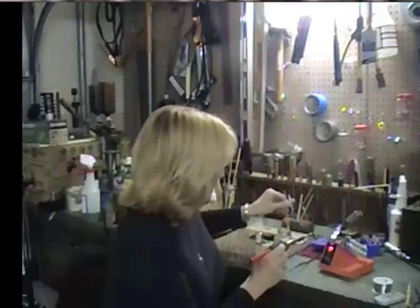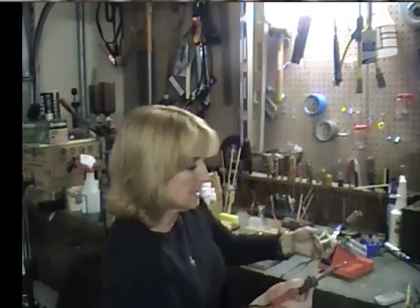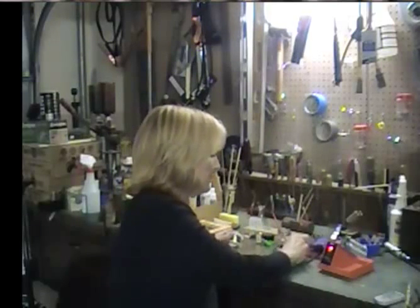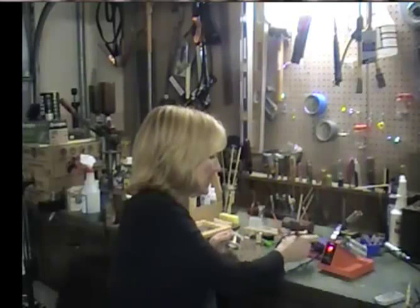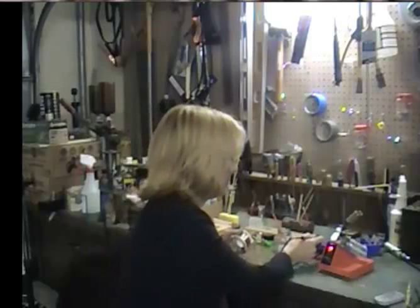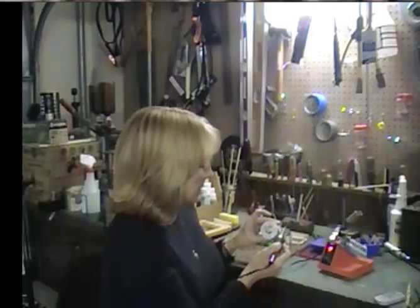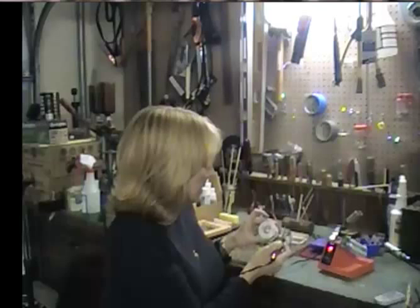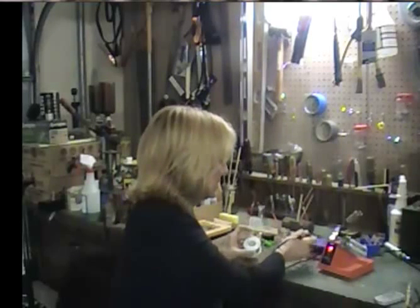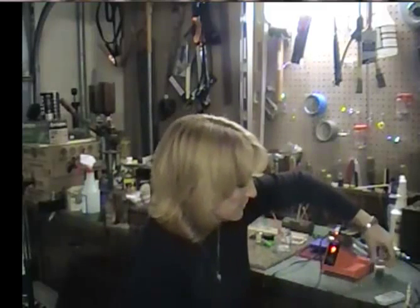I've got it on three because I didn't want it to overheat while I'm talking. A lot of people say don't dip it right in, don't put flux directly on the thing. You've got to keep the tip silver. If the tip starts turning black, you're going to mess it up — either burn it out and have to replace the tip, which is expensive, or go through a big process to get the tip tinned again. You want to keep it from getting oxidized, so keep cleaning it on a wet sponge and keep putting a little flux and solder on the end to keep it from getting too hot and burning off all the solder. Once the solder burns off and it gets oxidized and turns black, no matter how hot it gets, it's not going to melt the solder.